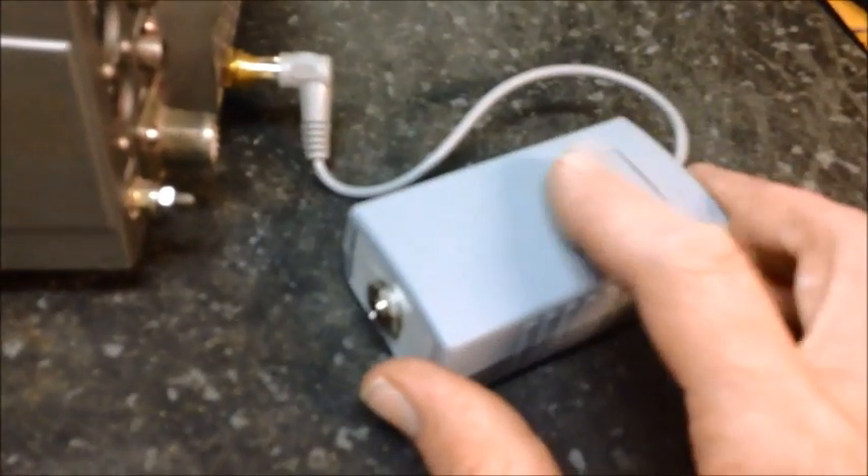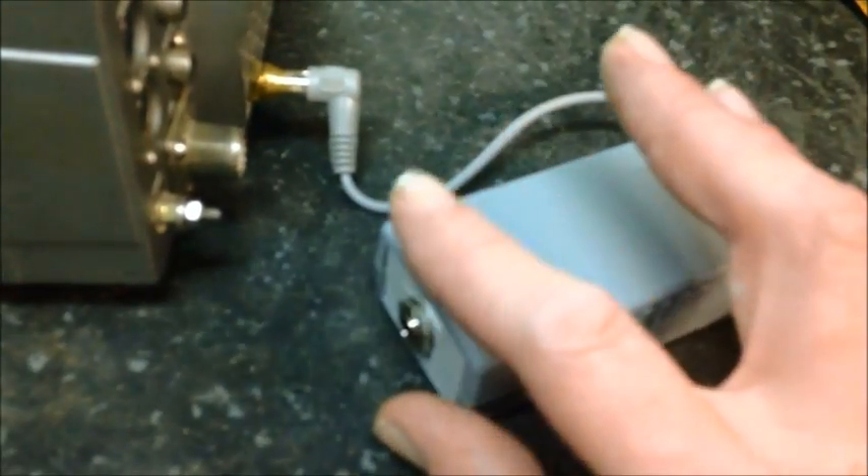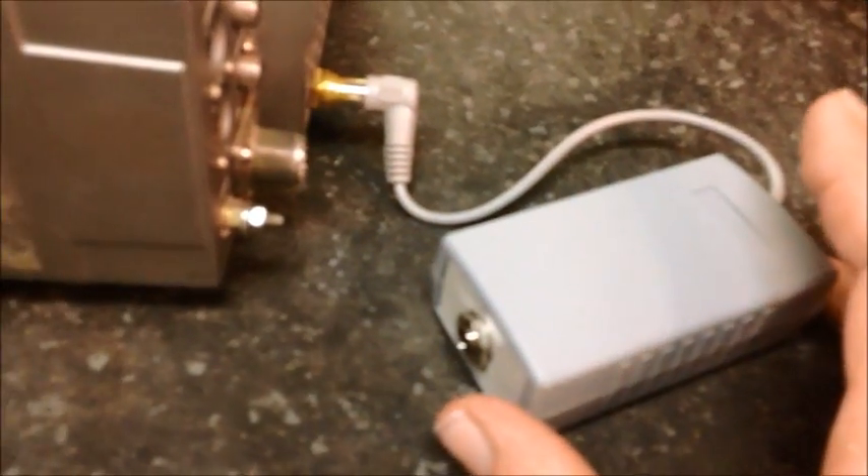Now this has a one-to-one transformer in it, which is what you really need. It also has RF blocking caps, ferrite beaded lines, a whole bunch of stuff. There's a whole lot that I do in these so that we can accommodate these big amps and stuff.